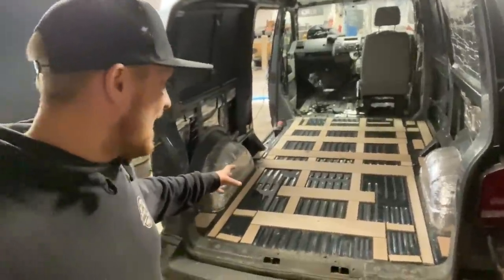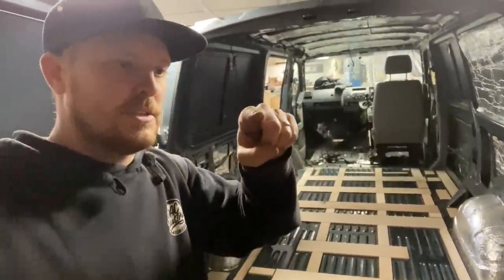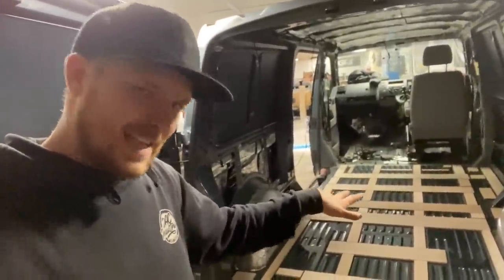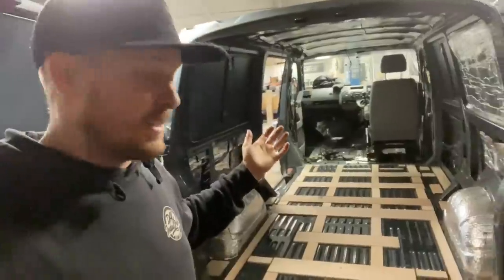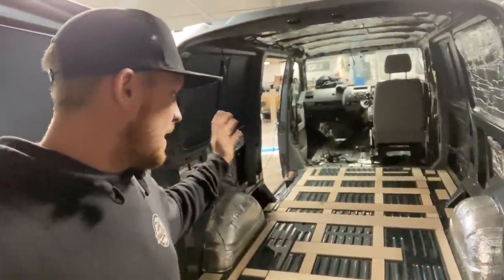There we go — those bits are down, bonded down with mastic. What I tend to do is create a circle with the mastic — several of them on one piece — and then when you push it down and move it backwards and forwards to get all the air out, the circle creates essentially a vacuum and holds the piece in place and sucks it down. In my experience that seems to work well. I've checked them — it's been 10 or 15 minutes and they all seem okay. Nothing's lifted, nothing's moved, everything's down where it wants to be. See you in the morning when these have gone off and we'll make a start throwing the insulation on the floor.